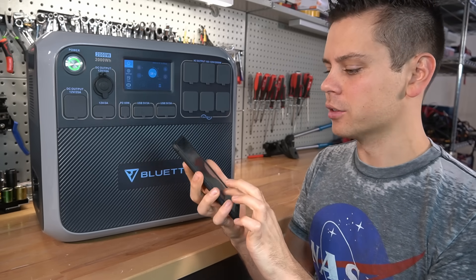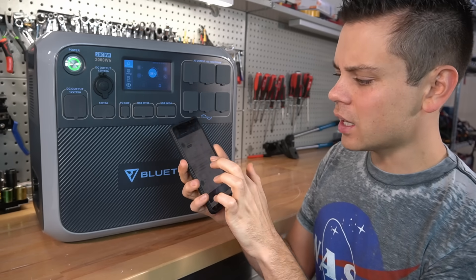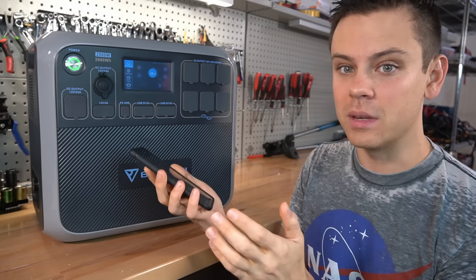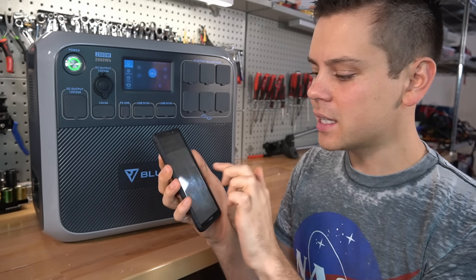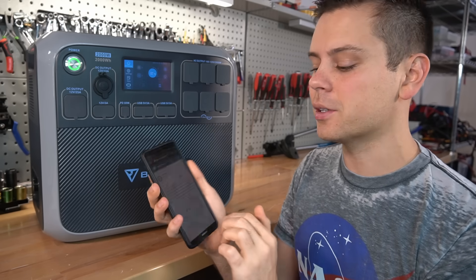The next problem is random error codes. One person had error 34 — no BMS — and somebody else got error code 80, but there's no documentation showing what that error code means. Others got a BMS communication error. Another member reported no error codes, but the temperature reading is horribly inaccurate — 30 degrees Fahrenheit below the actual temperature.